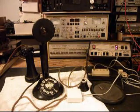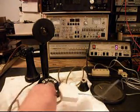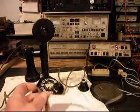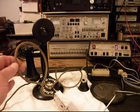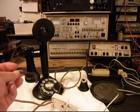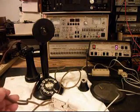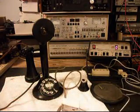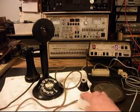So what we want to do here is, first of all, we've talked it over with John, and we could get rid of the modular jack that they have installed on the line cord, and we're going to go ahead and do that because we want to get a 6-foot cord on. Although this cord is not in that bad a shape, it is kind of discolored, and we're going to get something that is more the color of this cloth cord for the receiver capsule. So we're going to install a 6-foot modular cloth cord for the line cord, and then we won't have to worry about this modular jack any longer.